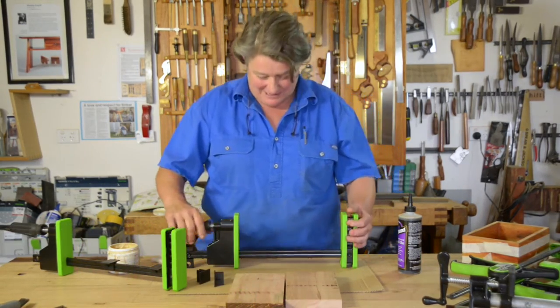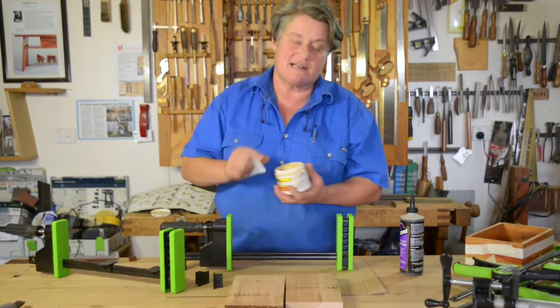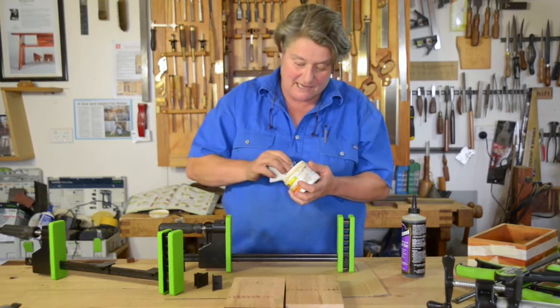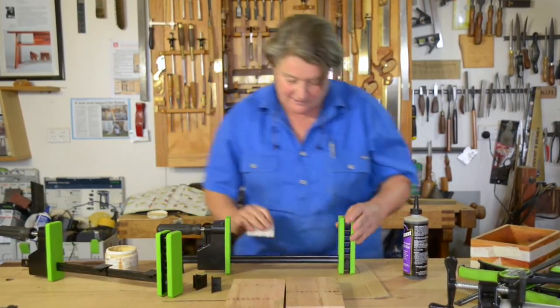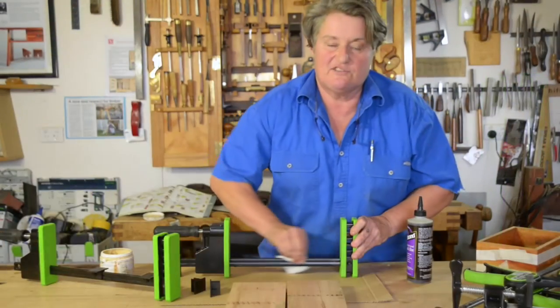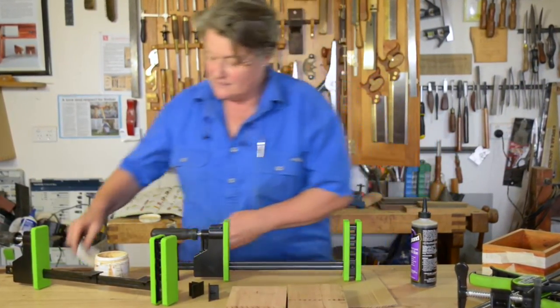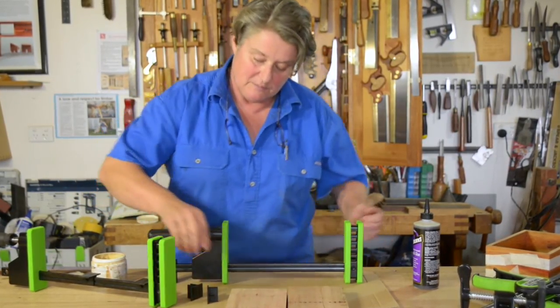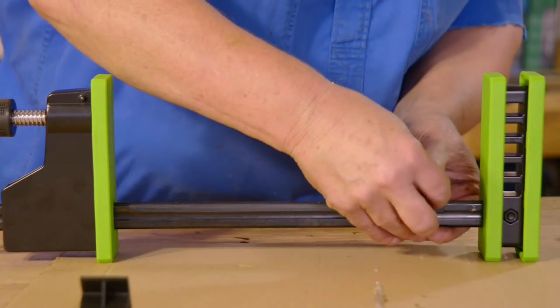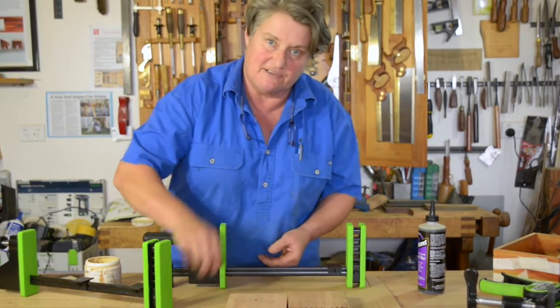So you've just bought a pair of these. My first job when I take them straight out of the packet is to put just a very light layer of wax down the metal arm. What that's going to do for you is keep these sliding really nicely. But also, if you do get any wax drying onto the surface, it'll just flick off after you've done your glue up.